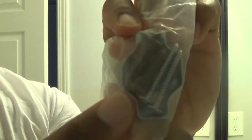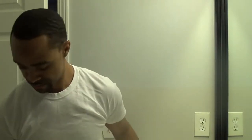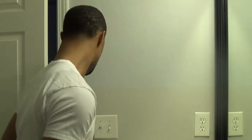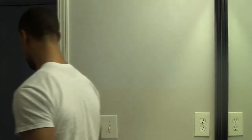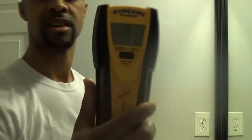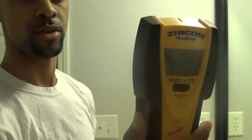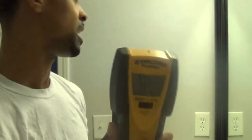In this packaging we have the bracket along with two screws and two wall anchors, and I will probably use both of those. But first let's get an idea of where we want to mount it. To do that we're going to need a stud finder. Your stud finder doesn't have to be that fancy, but I prefer this one because it locates metal pipes and electrical wires, so you don't want to hit one of those when you're installing anything.